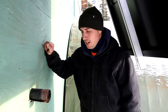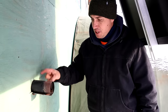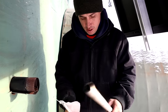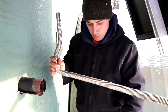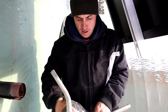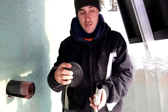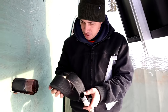The pieces I was going to use didn't work — they said they were 4-inch but turned out to be only 3.5 inches, so they weren't long enough. We had an old piece of stovepipe I was able to cut down, roll around itself, and stick in here. It looks a little ugly right now but we're going to cut this off. The exhaust pipe is going through here, and we're going to wrap it with exhaust wrap — the kind you'd wrap motorcycle exhaust or vehicle headers with. It's like a fiberglass wrap, and I have this on both our diesel heaters. It brings the temperature down a lot. Without it, the exhaust gets crazy hot; with it, you can actually touch it.